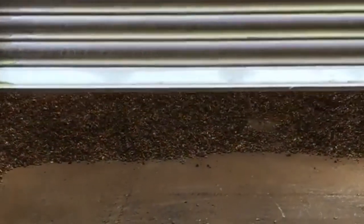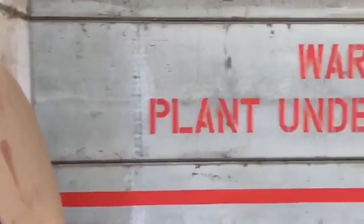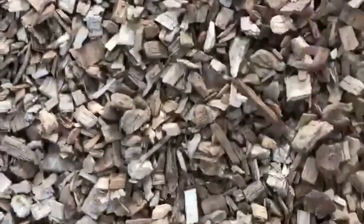The final inspection of the day is going to be the fuel store. It's always good to make sure there's still enough fuel, because we don't want to be caught out and run out of fuel. This is the storage area — these are the large mounds of wood chipping. They're bought in from the forestry guys who top these up quite regularly. Underneath the wood chipping are two gripping metal arms with a metal disc on top to protect them and stop them getting clogged up. Those metal arms constantly spin around and feed into another corkscrew auger that pushes up into the feeding pipes. As you can see, there's good quality, large chunky pieces of dry wood.